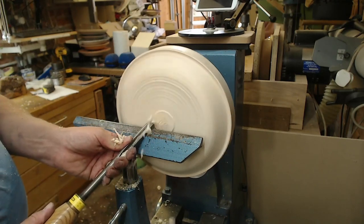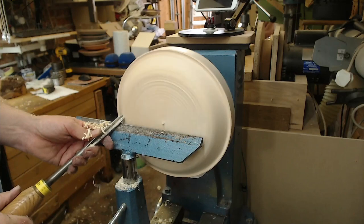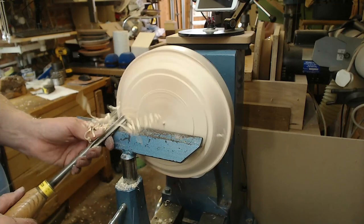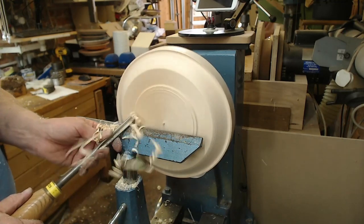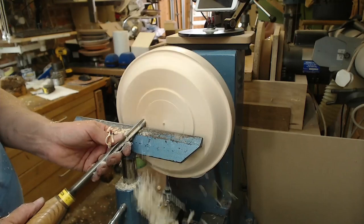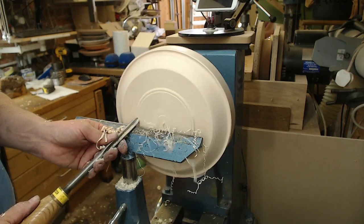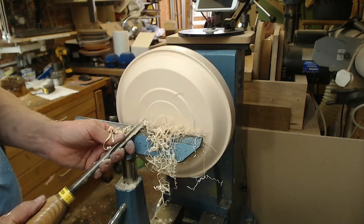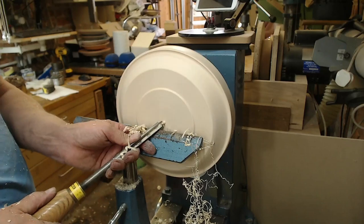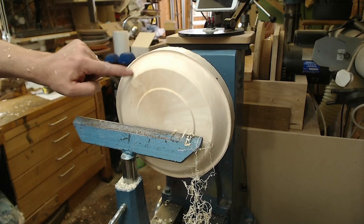Flattening off the bottom now, just trying to get the cut even and smooth, although I do need to resort to a scraper a little later on. I quite like using a scraper for the final shaping — the very fine final shaping — especially for skipping over the little knotty bits. I know I could use the bowl gouge in a scraping mode with a sheer scraping cut, but the heft of the scraper, which actually came to me as a large skew chisel, really absorbs any knocks going over the knot.